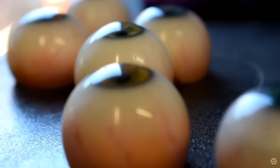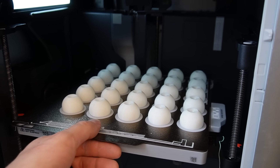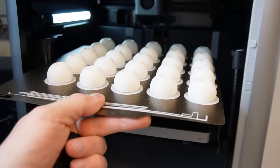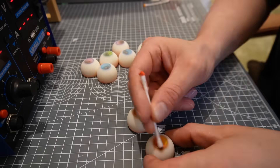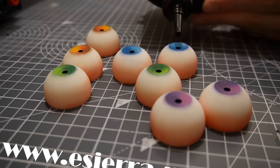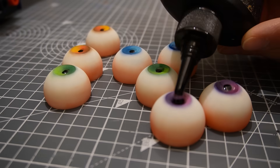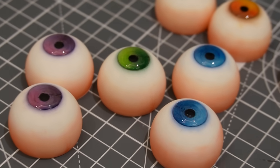When I did these eyes previously, I made an entire video dedicated to how I painstakingly made molds and castings, but I wanted to make a version that had no mixing, no pouring, no airbrushes, and no casting. I printed the eye blanks in ASA — with its translucency and low layer height, it's pretty much impossible to see the layer lines. The iris is concave because it gives the illusion of depth, and that's why the iris is a solid hole too. I painted the irises with watercolour pencils and pastels, layering up gradually between coats of Mr. Superclear, and finally used some UV resin to help get the effect of the cornea and add some depth and realism. It's not as good as my original solid casted eyes, but I was pretty happy to have a result which looks great from a distance with only a fraction of the effort and expense.